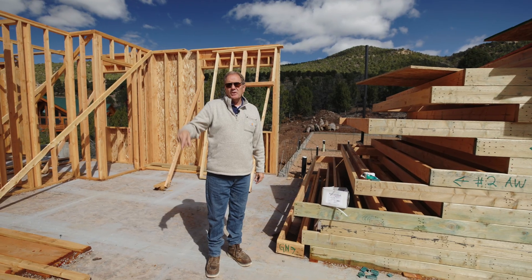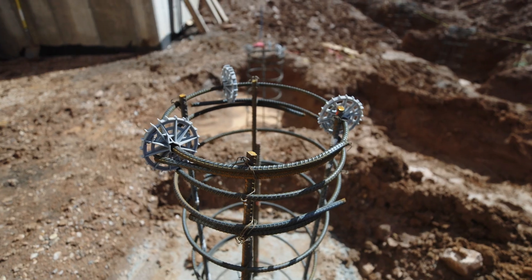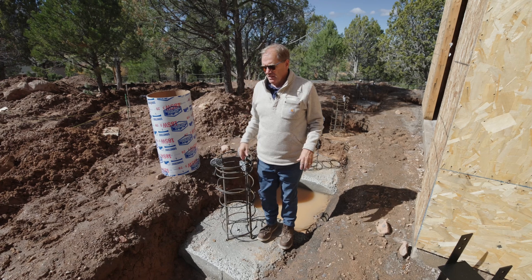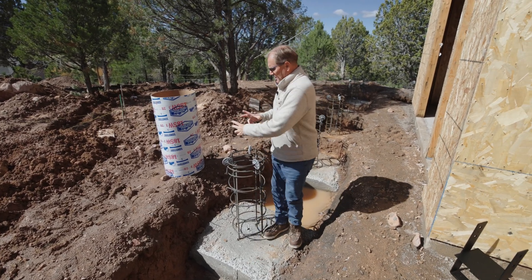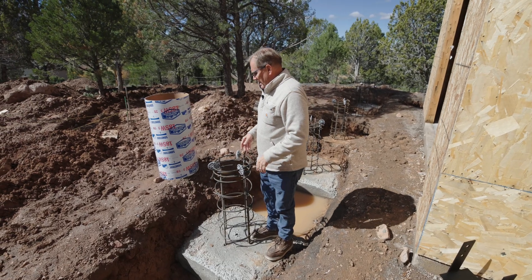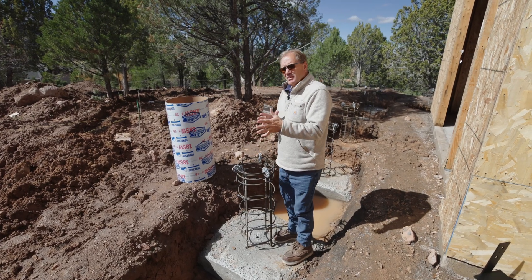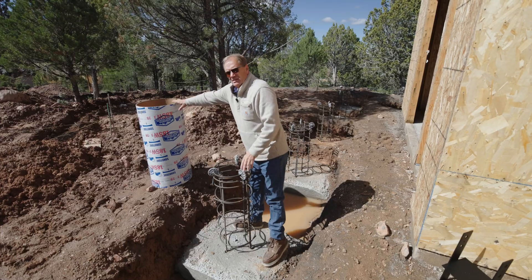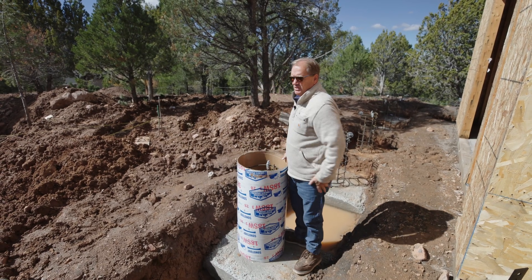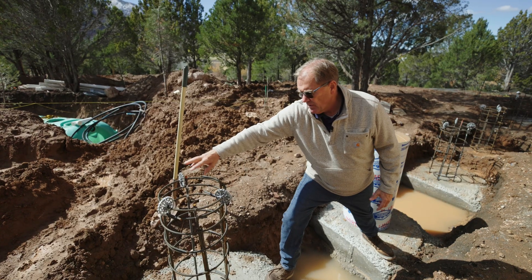Let's go down below and I want to show you some piers and talk about pier supports. These are some pier column supports for a deck that's going to be above here. I'm really kind of overkill when it comes to strength. The engineer had this called out for five-by-five beams, and originally it was a 12-by-12 box, which is a little harder to frame. When you have such a long row of pier supports like this, you've got to be dead on with those 12-by-12s. So we're going with something different — the engineer approved this — and we have what's called a sonotube, with these plastic spacers you see right here, and this keeps the distance perfect all the way around that section.